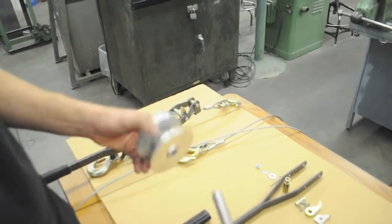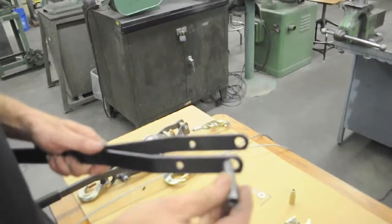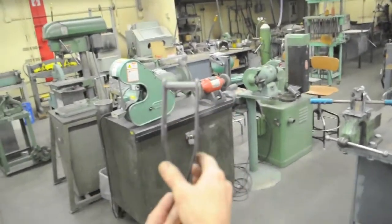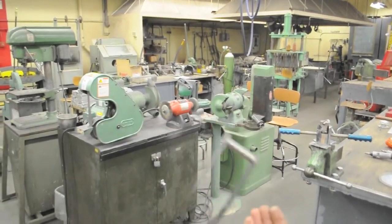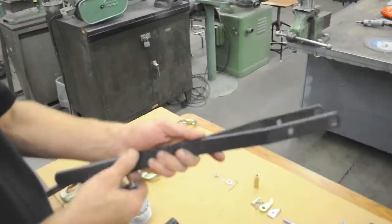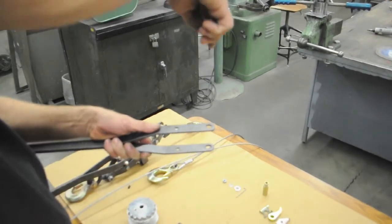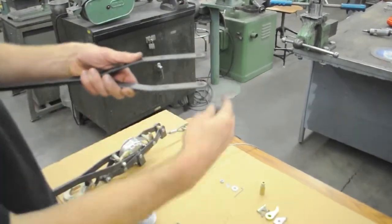Okay, and the handles. And you also might look and make sure that it's pretty much perpendicular to the handles. In order to get this to slide freely, after you rivet the handles together, you probably want to go back to the same reamer that you reamed the holes with and just hold the part like this and just pretend this is the reamer. Just run it right up on the reamer all the way through both holes.